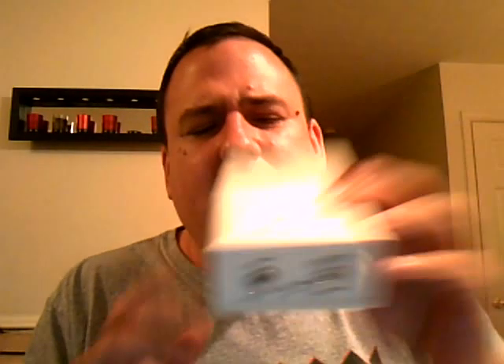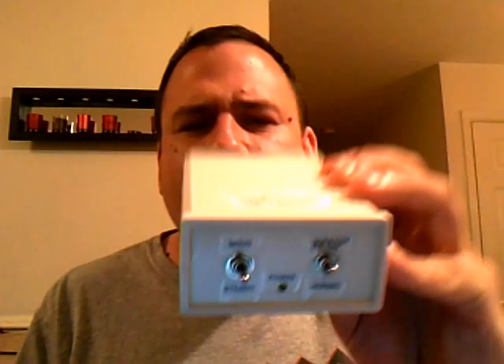Some people do say a true mono cartridge sounds a little better because of the way the coil impedances interact when you combine the output. If you have 3,000 mono records and want to play them exactly as they sounded in 1952, then get yourself a mono cartridge and a dedicated turntable. For the rest of us who have maybe a hundred old records or a bunch of old 45s and just want to get rid of the noise, a mono/stereo switch and a high-cut filter will do the trick every time. This is the Vinyl Liberator, built by Edgar Green — I'll put Edgar's YouTube link in the description. Thanks for watching, and it may be a little while before I get back to you, but I'll try. Thanks — it's JC, wave.